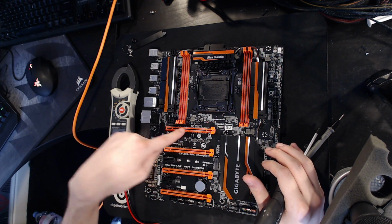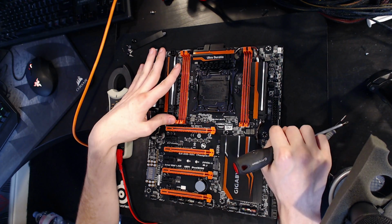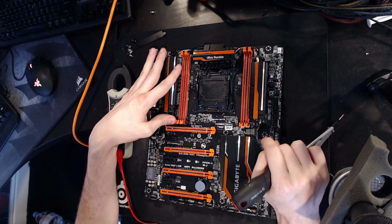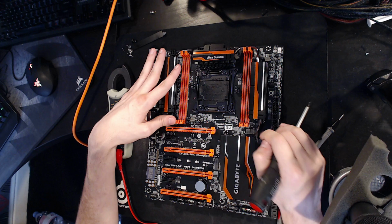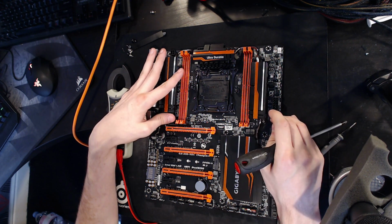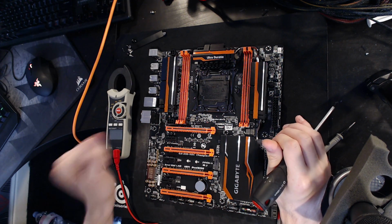And the problem is, your PCIe slots, normally, if you don't have that power connector right there, are entirely powered by the two 12-volt pins on a 24-pin. There's not a lot of 12-volt connectivity on the 24-pin. So the end result is that those two pins get really overloaded if you're running a 4-way or a 3-way crossfire setup or a SLI setup with the wrong card. You overload those two pins and they burn out. So you get that 6-pin power connector there to avoid that issue.